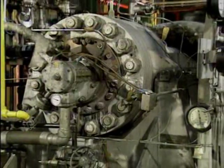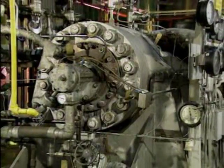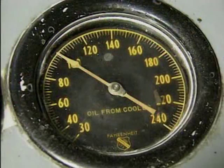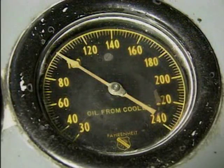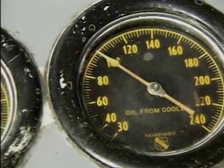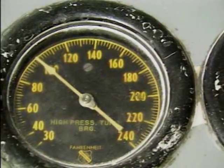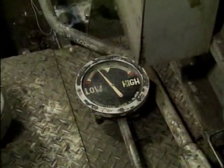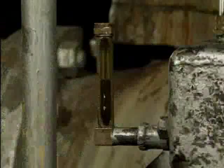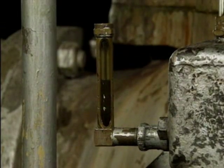Under heavier loads, the bearings in these pumps require a forced feed system to ensure proper lubrication. A forced feed system may contain its own pump, reservoir, heater, cooler, and filters. The pump should be checked to make sure it is producing the correct pressure. The oil level in the reservoir should also be checked. This can be done using a level indicator or through a sight glass.